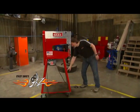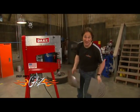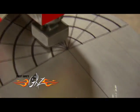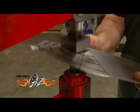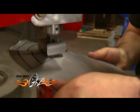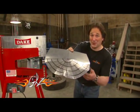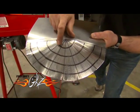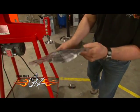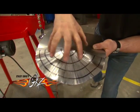We've already showed you how well it stretches and shapes metal; now we're going to show you how well it shrinks and shapes metal. On the first pass, we'll go all the way to our innermost line and work our way back. Believe it or not, that is how you want it to look after the first pass. We've got nice shrinkage right around this innermost line — that is what we were after. Of course the rest of it looks like a potato chip, but we're going to take care of that by shrinking to this line, then to that one, then to that one. It's going to draw it all in.